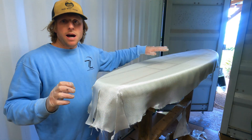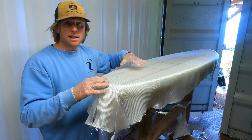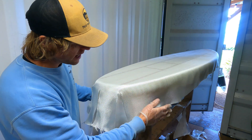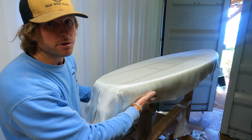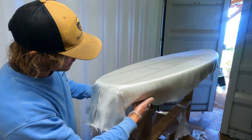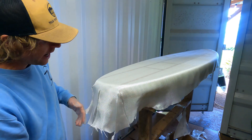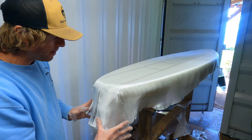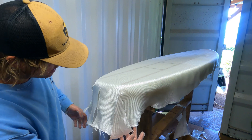I've just cut the carbon patch, taken that off and put it to the side, then pulled the full length of glass and laid that on, cutting it all the way around so it's longer than needed to meet the cut lap masking tape. Now before we mix up the resin, I'll explain the cuts in the tail — we've got so much lap because we're trying to wrap it all the way around to that tail. There's a cut going into the stringers like we did on the deck, coming out on an angle, and then another cut to make a triangle.